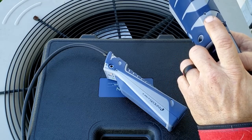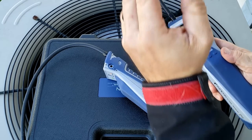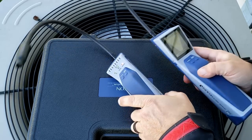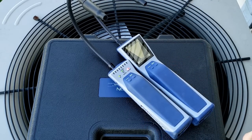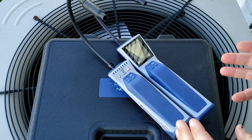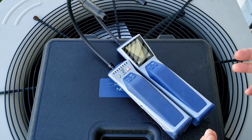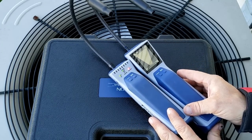Regarding false alarms — there's a port on the back. This port is used in cloud hunting mode because the pump inside starts sampling refrigerant levels from the tip versus what's inside the body, trying to find a differential. You'll hear a clicking noise in cloud hunting mode, and that's also what reduces battery life by about an hour. I've used it in cloud hunting, manual, and traditional pinpoint modes. Pinpoint mode gives the best sensitivity and fastest response. Cloud hunting is truly designed to limit background so you can narrow down your location, not for finding leaks the first time.